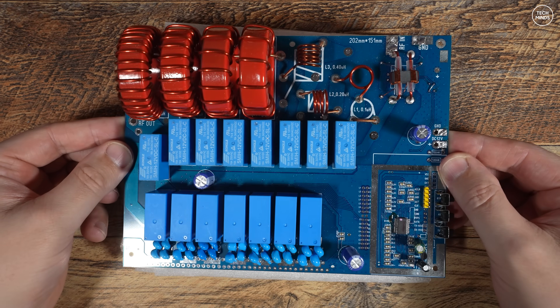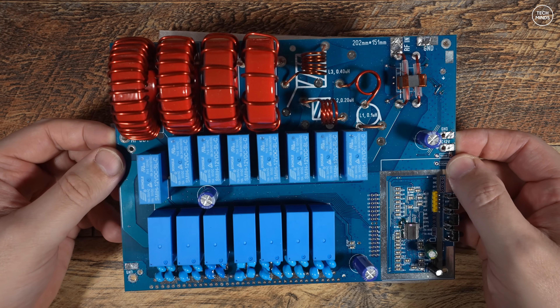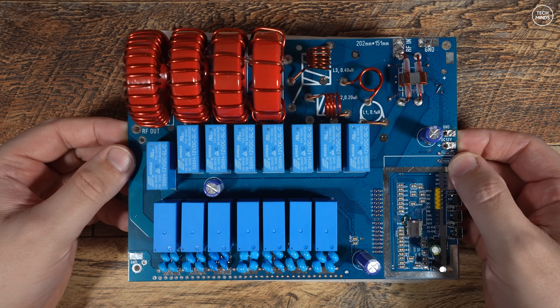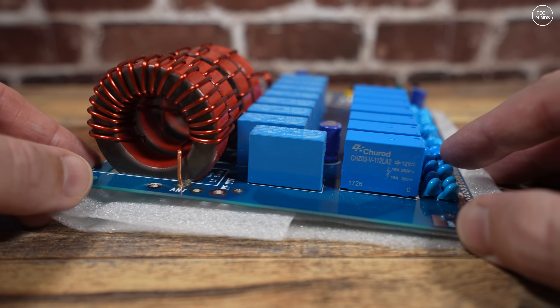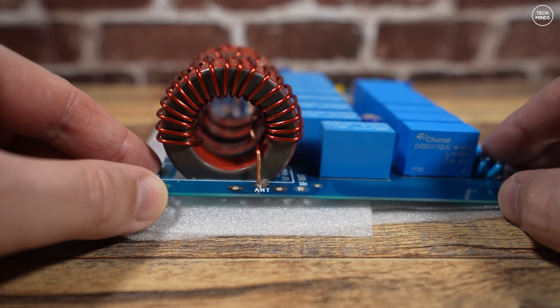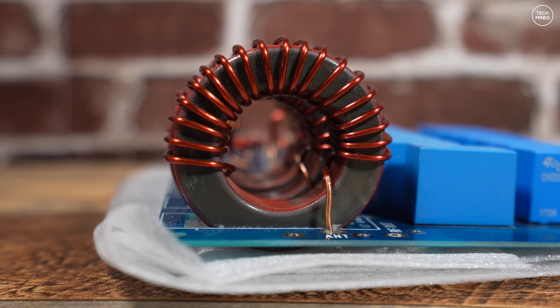The reason for the taller box for this ATU should be quite apparent after seeing this main board. It's because of these toroids — the four red large circular things. They're much larger in this 350 version compared to the 50 version, and that's all down to it being able to handle more power, up to 350 watts.